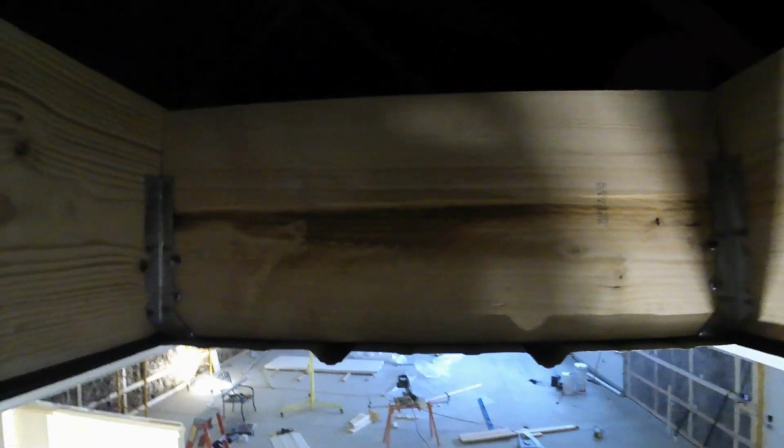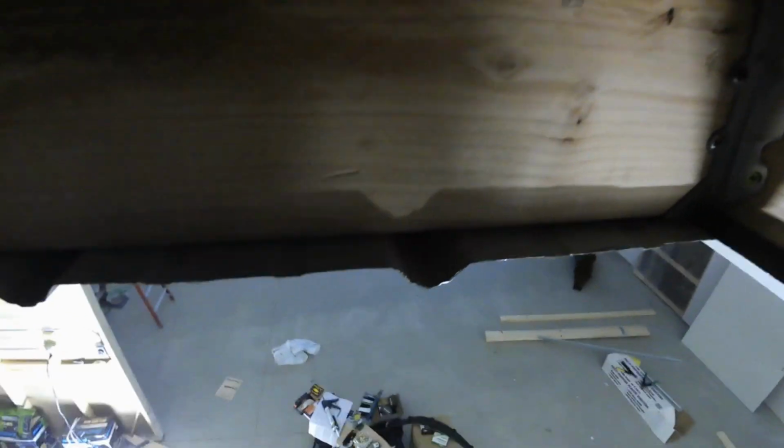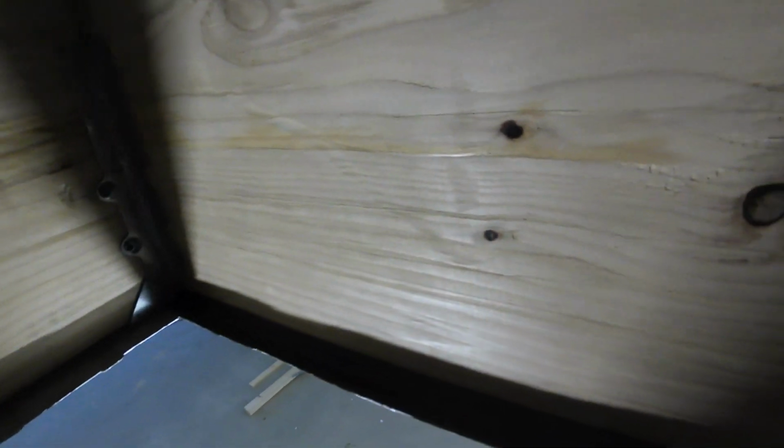You can use whatever size lumber you want. I use 2x12s because my insulation is that thick. We want to make sure that you put an overhang on there, a 1/2 inch to 1 inch lip, so that your OSB panel will sit flush to it. And then what you can do is insulate above it, and then it'll slide right down on there.